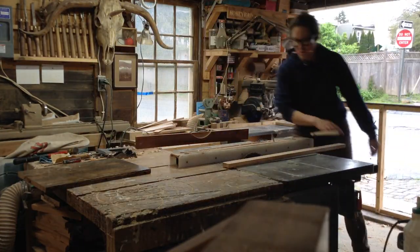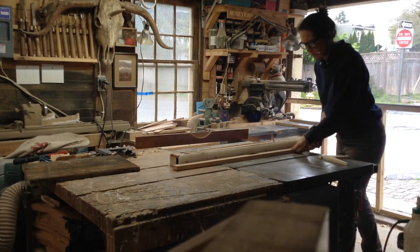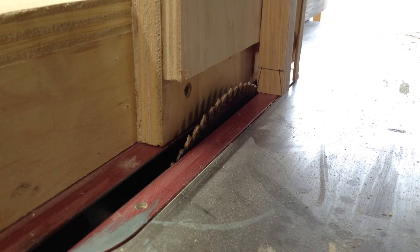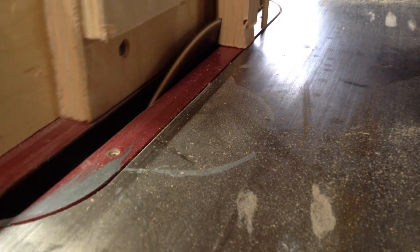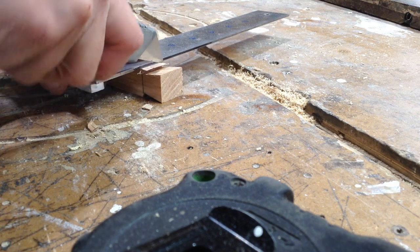For the top rail I'm going to be joining it with another piece of that red oak, and I'm going to be putting a dovetail on it. I've been using dovetails a lot for applications like this just because once it's in the piece, the end of that dovetail holds things together — they technically can't slide out because the end of it is wider than the front. I set my blade at about a 10-degree angle using a tenoning jig, cut two angles on that side, and then used a razor blade to remove the excess, leaving me with a dovetail on either side.